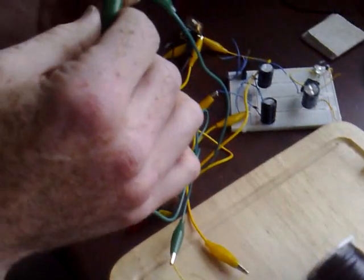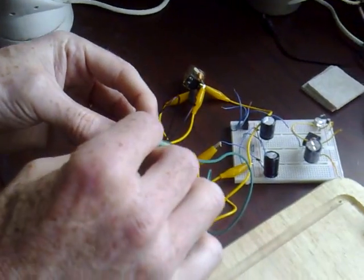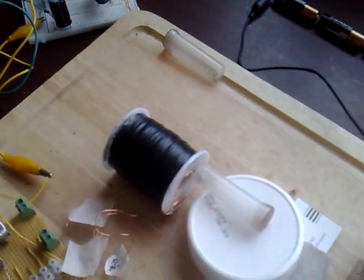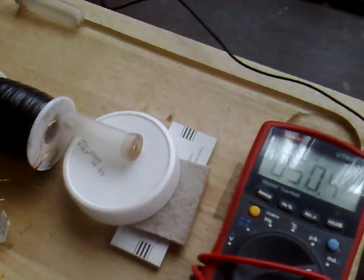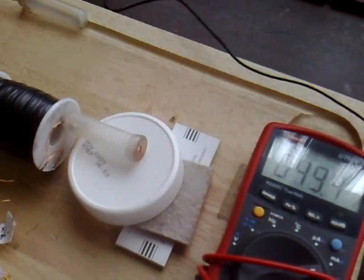Now I've done one change in the circuit — I've changed the 10k pot to a 100k pot, and I seem to be able to get a lot more speed out of it this way. I'll turn it slowly, and I'm getting a milliamp draw of around about 5mA.